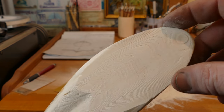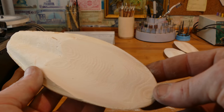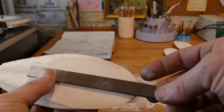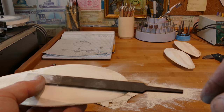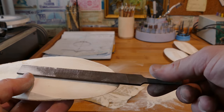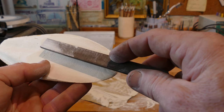What we're going to do now is carve a ring shank in there. We're going to be using this — this is our baby, the wax file that we talk a lot about. If you guys want to know where to get the wax carving tools, check out the information in the description box below. But for today we're going to be using it for carving cuttlebone — carving a channel in here a couple millimeters deep.